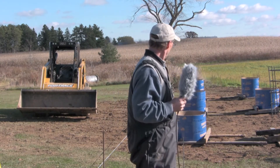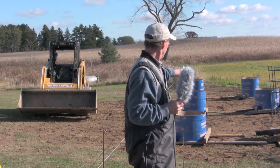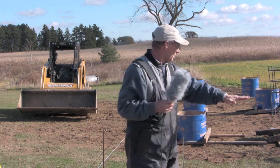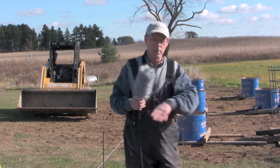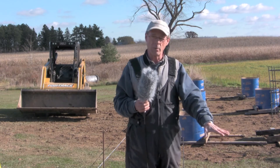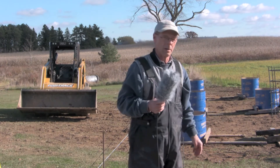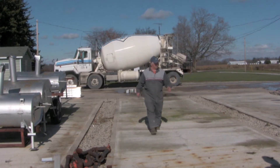Next weekend, as I mentioned, we will bring the soil grade up to elevation, six to eight inches from the top of the tubes. We will then cover the surface of the ground around the arrays with a tight woven ground cover, and on top of that we will place gravel or stone to keep the site pleasant to look at, so we don't have weeds underneath.